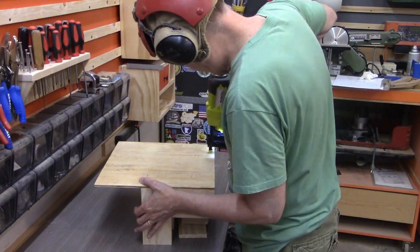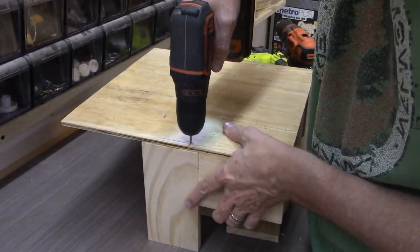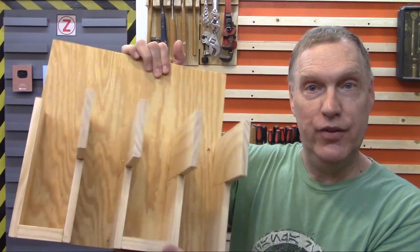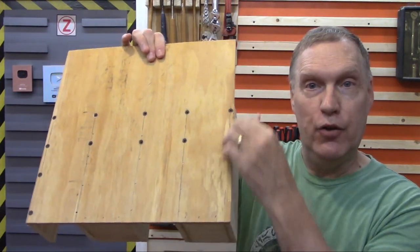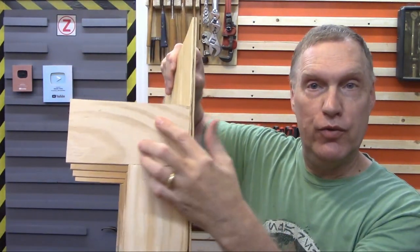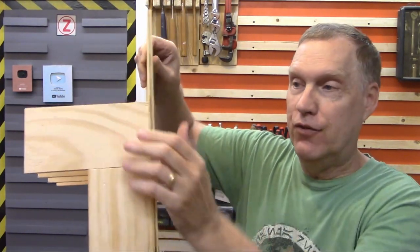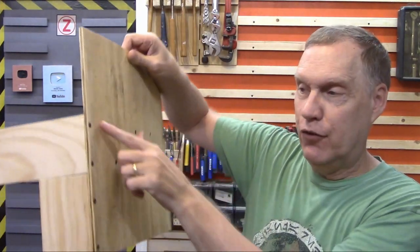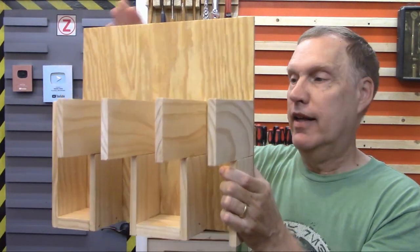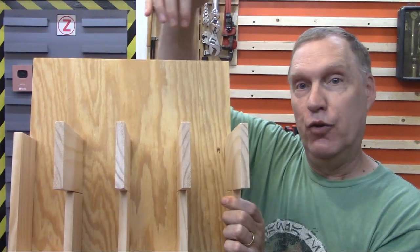The easiest way to build this is to glue the strips on the left and right sides of the bottom pieces, then clamp them — because clamps are good for everything — then use your nail gun to put nails in to hold it together. These bottom pieces are going to hold a lot of weight, so you definitely want nails or screws here, not just glue. With those two U-shaped pieces glued and nailed together, it's a fairly simple matter to lay out the rest of the structure. Keep that 2.75 inch gap between the two nail holders — this is where your nail guns will go and you need that width. The next day, once the glue is dried, I use the nail gun to put nails into the rack. Then I add screws to the back of the nail gun mounts: the screws keep these supports from falling out since the weight is cantilevered over the edge. Screws down the side keep the side piece stiff — these are pretty tight and not going anywhere.